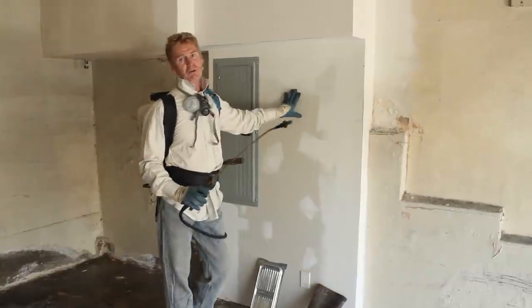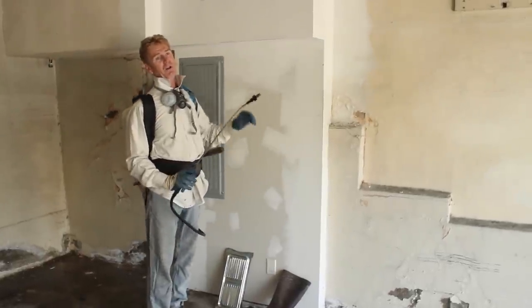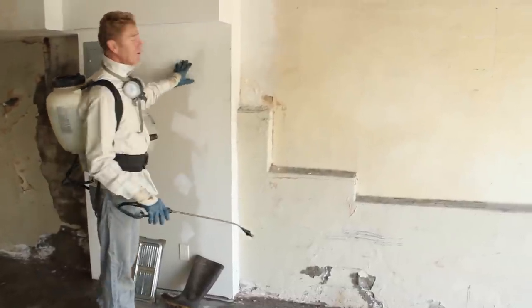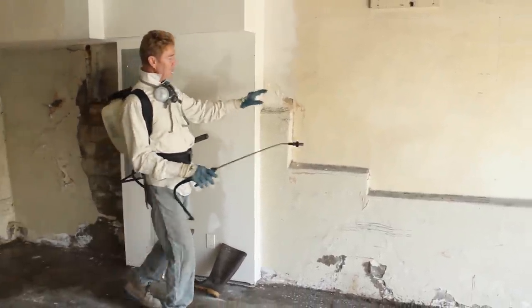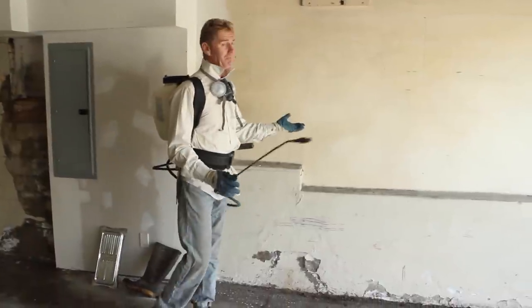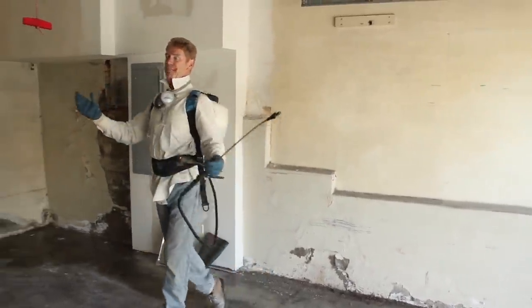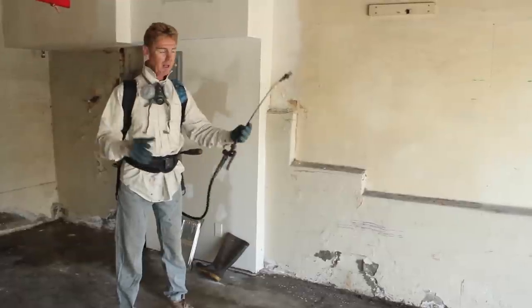Here's sheetrock. When sheetrock gets wet — like in the floods and hurricanes — it reverts to its natural self: putty. So this becomes putty. What we're going to put here is not sheetrock mud or taping mud, but pure gypsum — Structolite — because Structolite has lime in it. Crushed limestone mixed with gypsum. It can get wet, and when drier conditions occur it dries right out.